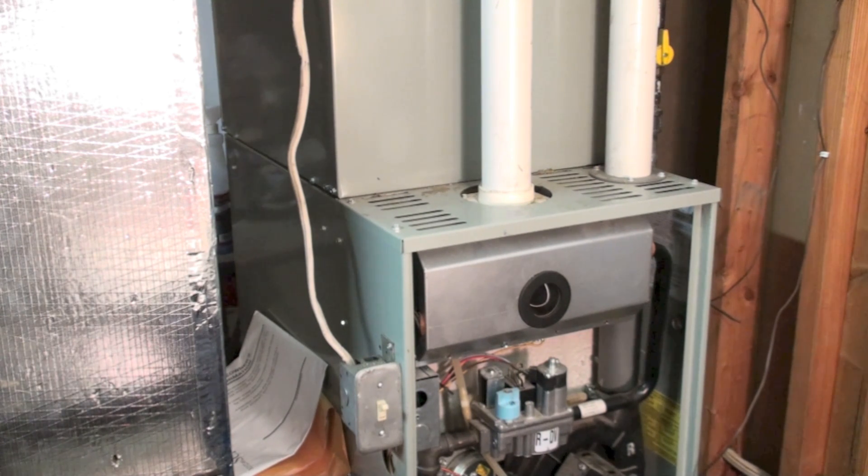Years ago when these things first came out, I thought great, we can get these stupid furnaces out of the laundry rooms. Because we were starting to get the newer style furnaces with the thinner heat exchangers. Now thinner is not necessarily bad — it's just that it's going to rust through easier. It transfers heat faster, so that's why they're using it, but they can rust through.